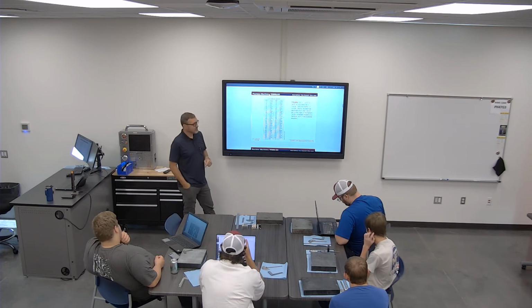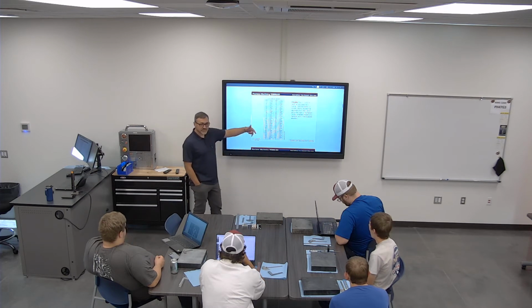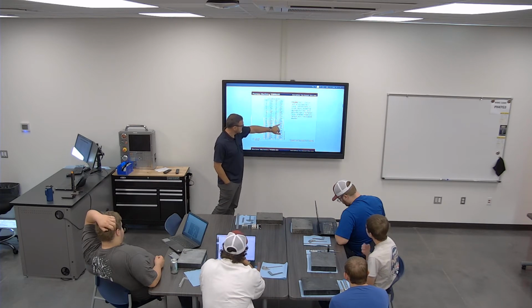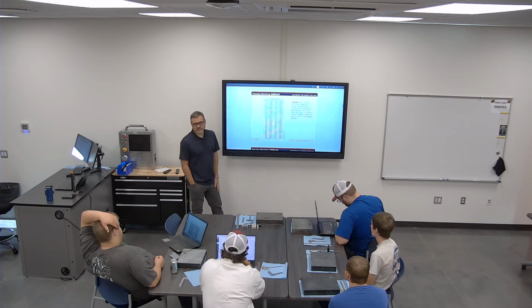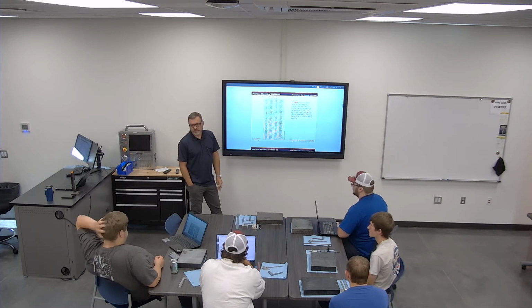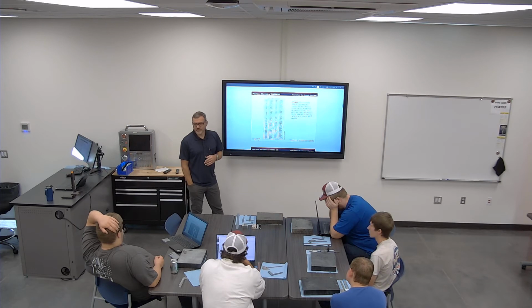Like 51/64, should I just read 796 thousandths? On that one, you're going to go out three decimal places, and then you're going to add the and. So 51/64 is 796 thousandths and almost 9/10, almost 9/10 thousandths of an inch. Are we going to have to read this? That's a big number. You start to get out to millions then. There's no rounding up in this stuff, is there?